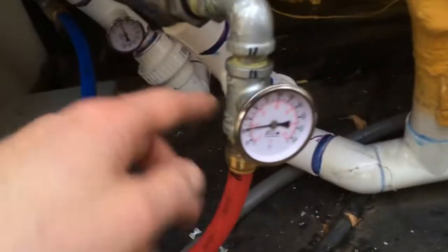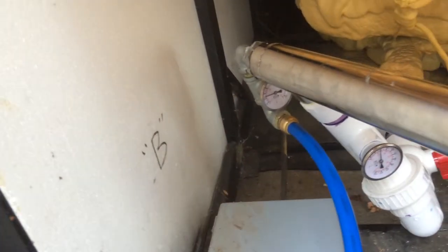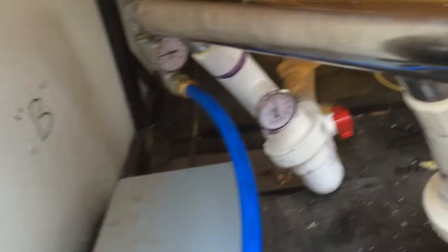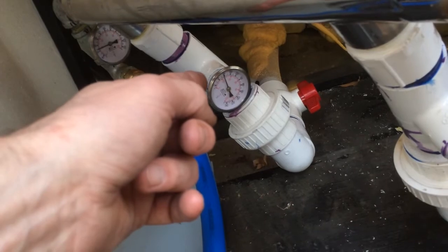Normally coming off the hot water heater itself, I'll see somewhere close to about 130 degrees. By the time it exits the heat exchanger it's usually down to about 105, maybe 110 — so it's giving up a good 20 degrees or more of heat. On the spa side, there's less of a difference: you'll see about 88-degree water coming in and maybe 90-degree water coming out to heat the spa.